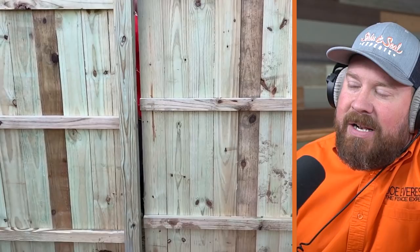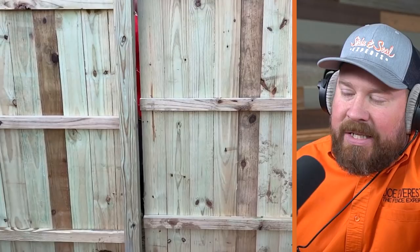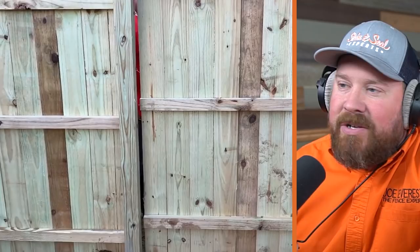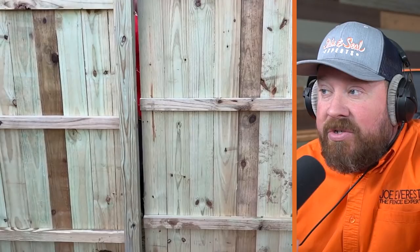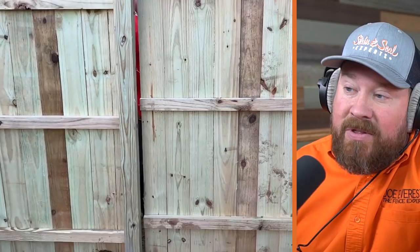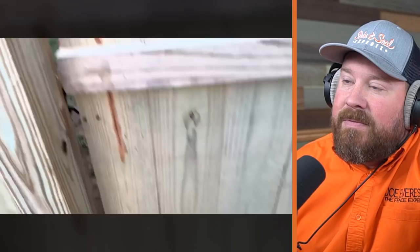What happened here is they just used a regular panel and tried to make it into a gate, but they didn't align the height of the fence. So you have structure on the gate not meeting the structure on the latch post. They set their latch into that structure, which gave them no choice but to come below the structure. How hard would it have been to add a two-by-four vertically between that structure? This gate doesn't have any sort of structure to it that will support it as a gate.